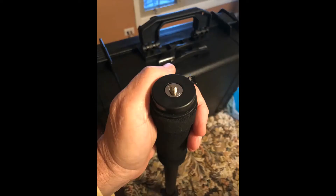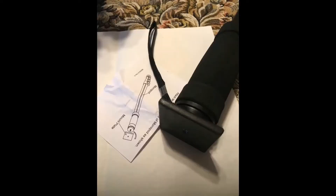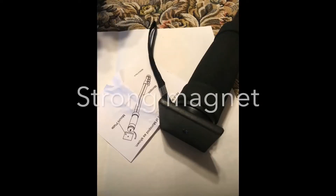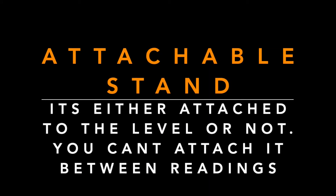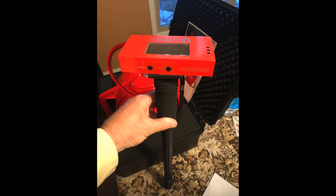There is a magnet that you can attach to the top of the stand and that connects to the base of the level. But if you do use the leveling stand, you must use it for every reading for that circuit. You can't take it on and off and then expect to have all the levels in coordination.